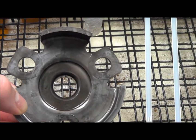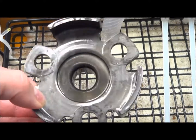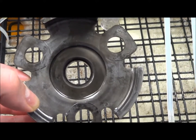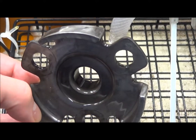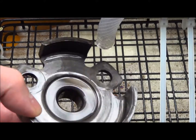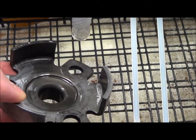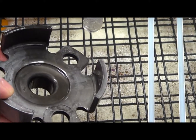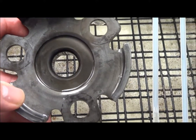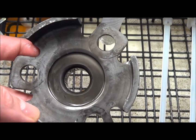In cases where you cannot immerse the part, you could set it up with something to funnel back down into a basin you could pump from, and then just pump the Evapo-Rust and flood it over the surface like a waterfall. You do not want to put pressure on the nozzle — it's just something that flows — because Evapo-Rust is very foamy. But if you can just flow it over the part, then it works very effectively, as you can see here.